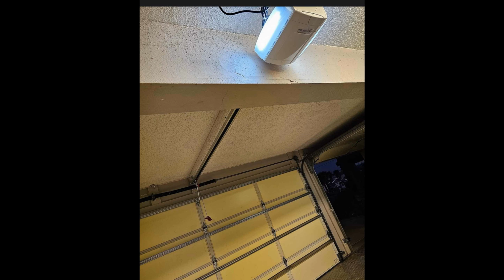Alright, so starting us out here, it looks like a Marantec Synergy 370 probably. Basically they just decided they were going to cut and install the opener straight through that structural support beam running through the garage, as usual, instead of just doing a jack shaft. You see this all the time, and of course the setup was probably originally there before they had jack shaft openers, but now you have the jack shaft opener, so the way I see it, might as well just do the jack shaft.